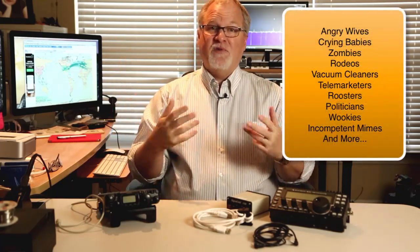So while you're talking, everything you're saying is going out over the world. When you quit talking, after some variable hang time, delay period, it switches back to receive mode. And you hear hams on the radio using that all the time. If you want to be hands-free, you can go into Vox mode. Now, you also have to worry about coughing or people talking to you in the background or any kind of audio that might trigger that.